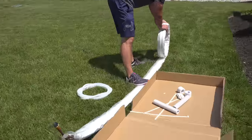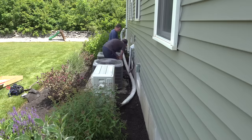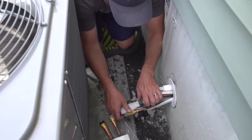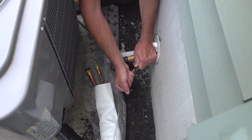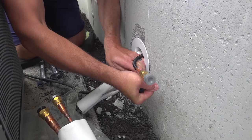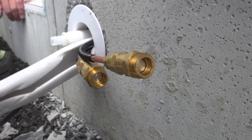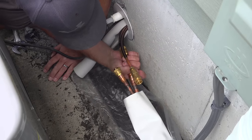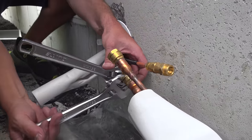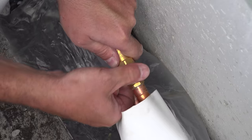Now we connect everything up with the hose kit that comes as part of the package. Roll it out and keep all the hoses in place behind the units before connecting. There's a protective wrap over the white plastic that keeps it clean until the installation is done. Because our outside unit was located away from the hole, we bent the lines a bit to make connections easier — this is okay per the manual, but don't bend them to the point where they kink. The caps are just to protect the lines from dirt, not to hold in gas. The threads are very fine, so always start connections by hand before using a wrench. Mr. Cool includes two wrenches in the package — use both to prevent the pipe from spinning.